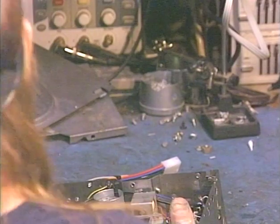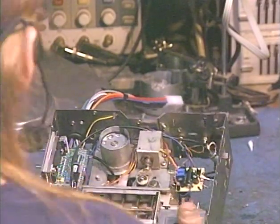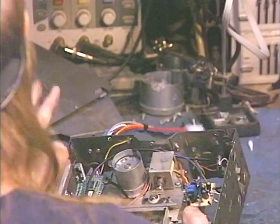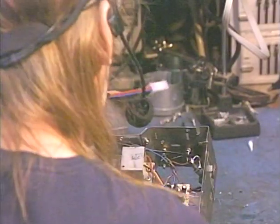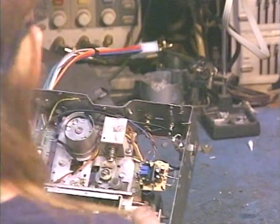No grounded wires in the speaker system — that's how you get that massive increase in output power. The original unit had two amplifiers, each capable of maybe four or five watts. Now it has four separate amplifiers each delivering 45 watts, so this is going to be a much more powerful unit than it was before.